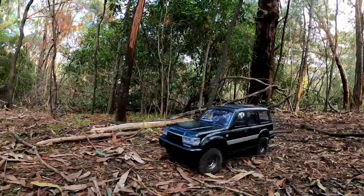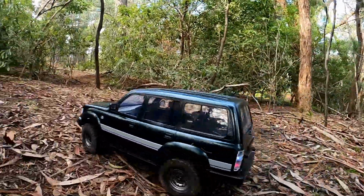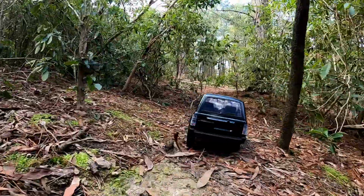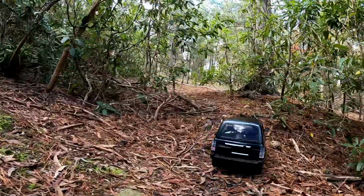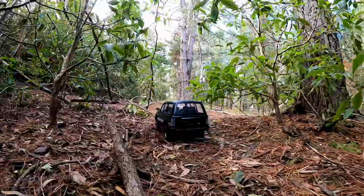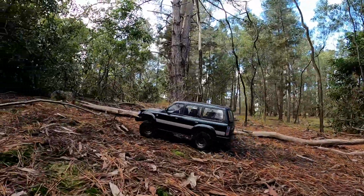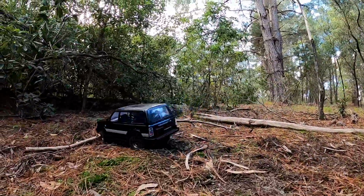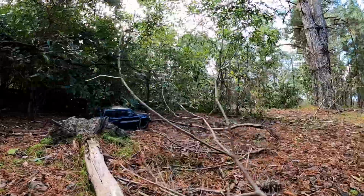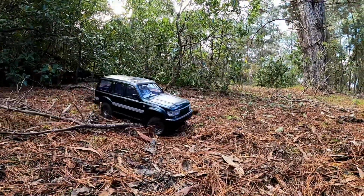On that note, I've had a lot of trouble getting a decent light kit that actually gives you realistic function. We don't need everything flashing all the time when there's no signal. You don't want your brake lights lighting up brightly when you're reversing. You just want the reverse lights on. You want the brake lights to light up when there's no throttle input, or braking after accelerating, if that's the kind of car you've got it set up on. I've got an Arduino project where I've been working on getting lights a bit more realistic, and I'll put another video up on that at some point.